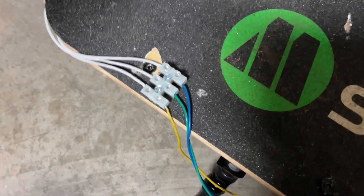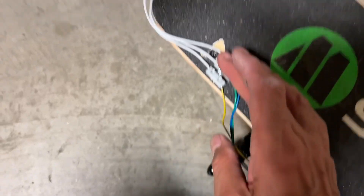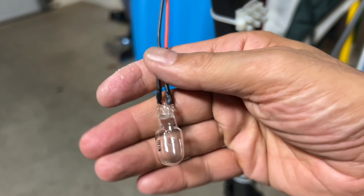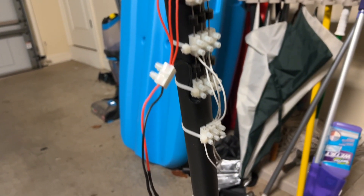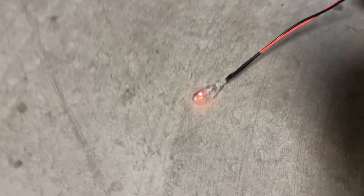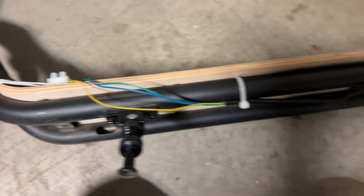Here's the final bike mod. Here's my three-phase output from the back wheel. The three phases go into this homemade three-phase rectifier, and I have a little test bulb here. I'm just going to hand-turn the wheel to show you how the bulb lights up. My three-phase rectifier is working and I'm getting DC power which I could store in a capacitor or do other things with.